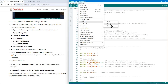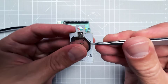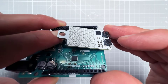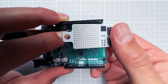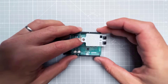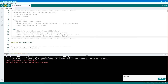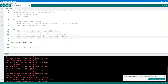The communication port must be set to the same port as the Arduino Uno. Remove the battery from the Keychain Nino first, then connect the ICSP headers in the correct orientation. Tilt the Keychain Nino so there's a solid connection between the pins — it gets 5V and ground from the Uno, so pressing both buttons starts the game. Jumping back to the Arduino IDE and pressing Upload, it compiles but then shows some kind of problem — it's not uploading. Unfortunately I wasn't able to solve that, so we'll need to use the Arduino Uno pins with wires instead.